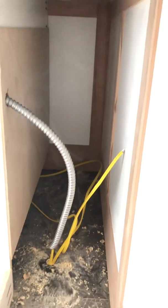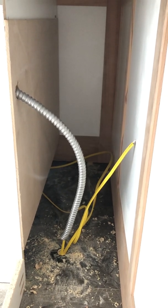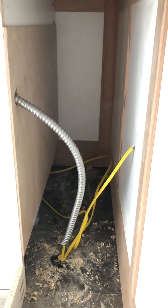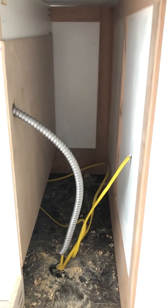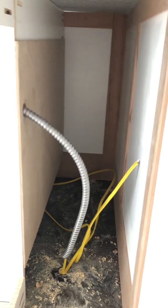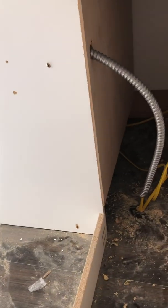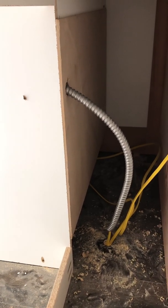I can see the wire in there — there's our wire coming through the floor. The one with flex goes over to the one under the sink; it has to be protected if it goes into the cabinet bay. But this one won't need flex on it because it'll be back behind in this dead space. It can come right out to the outlet. And right there is where the dishwasher will come in and stop at that wood, where the flex comes out.